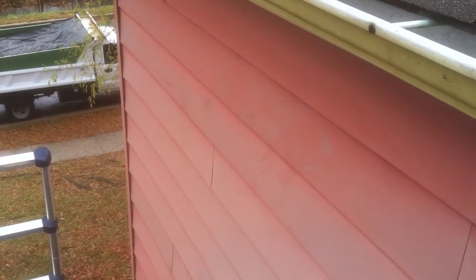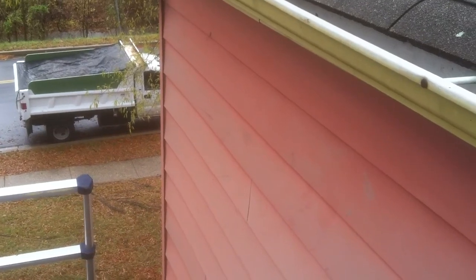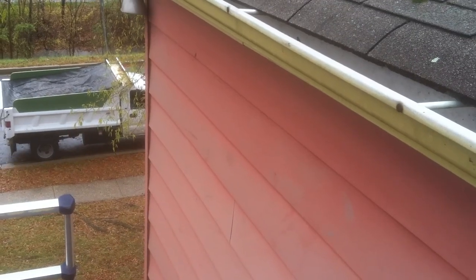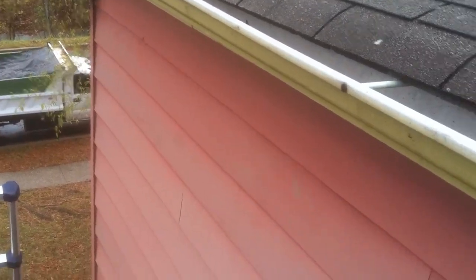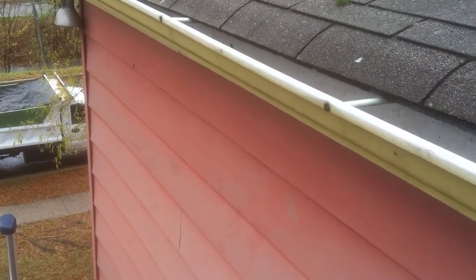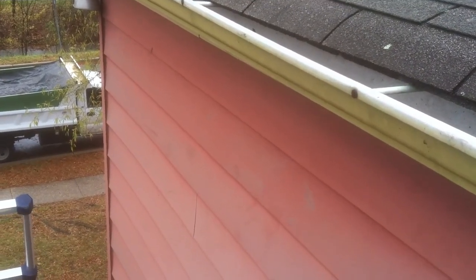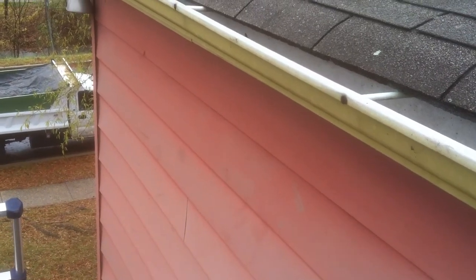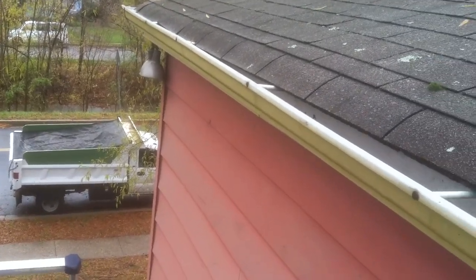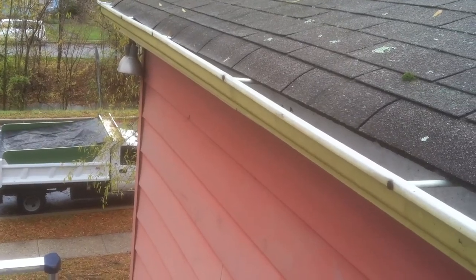You showed me the interior of your bathroom, which has the walls taken out, and behind the red insulation is a fiberboard, which is attached directly to the studs in the wall. That is not a very professional way of installing siding. You should have some sort of sheathing up, and that's going to create a platform to build your wall off of. So right now, if we punched really hard or kicked really hard, we may even be able to punch right through the wall system, which means the large tree that's in the front yard, if a storm rolled through and blew a big tree branch out, it could puncture the wall. So the sheathing is going to be very important.